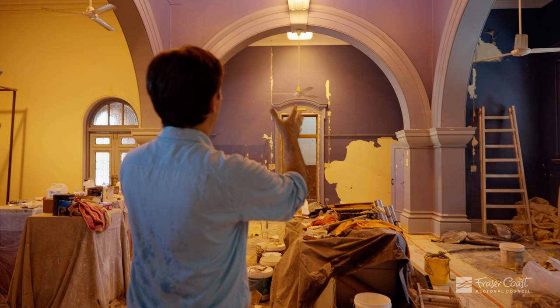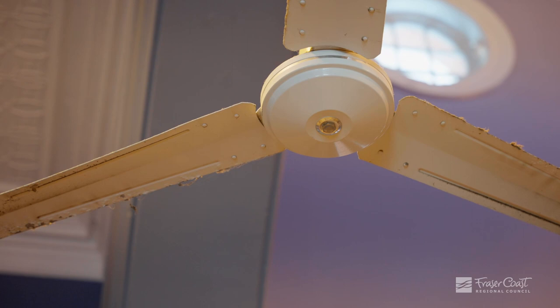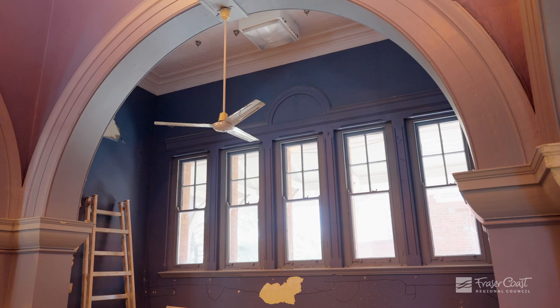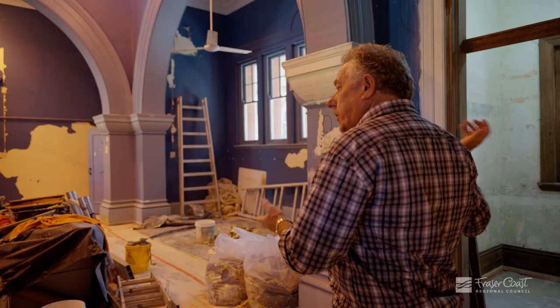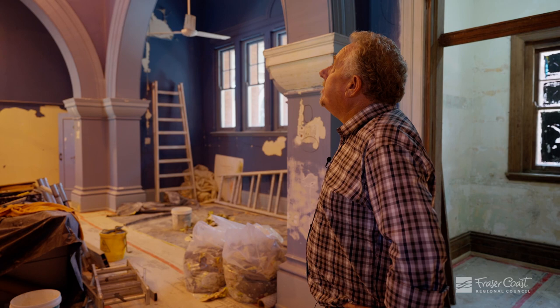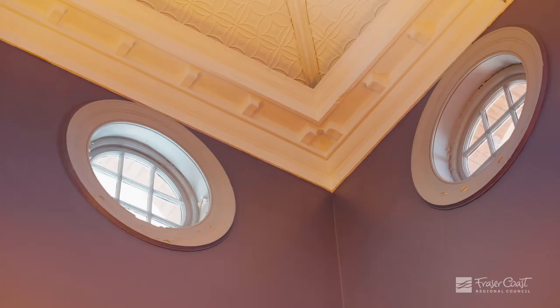And in the main room we're going to get rid of these more modern ceiling fans. They'll go, and all the surface wiring of course needs to be removed. We've removed all the conduits that went to light switches. The idea is to have a central single switch at the entrance — staff will be able to come in, press the switch and all the lights and power will come on through contactors and the main switchboard, with no need for any more switches anywhere that would ruin the appearance. It's a fantastic big open space with very high, beautiful pressed metal ceilings.